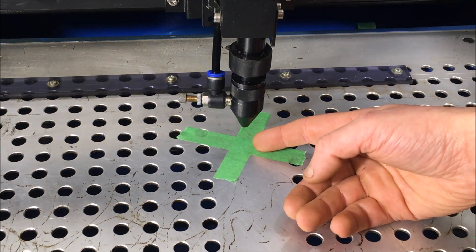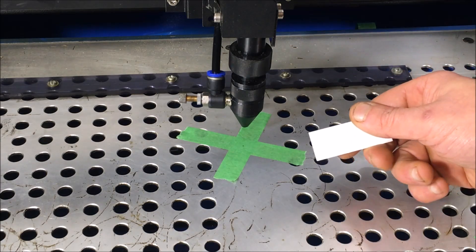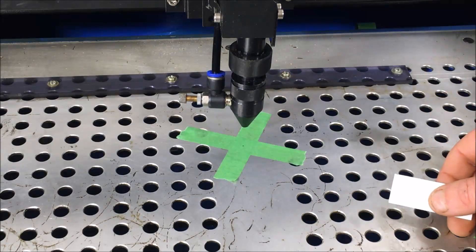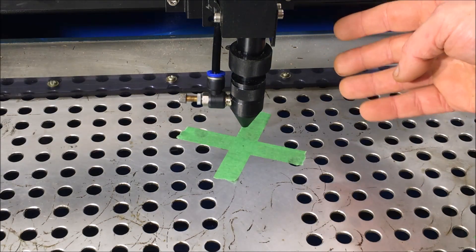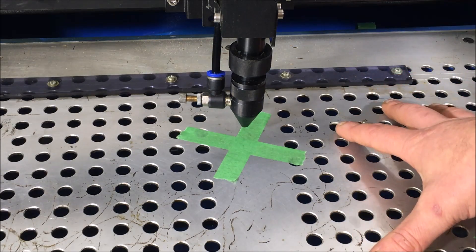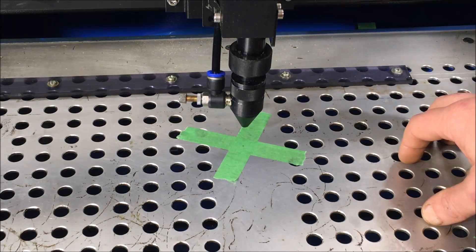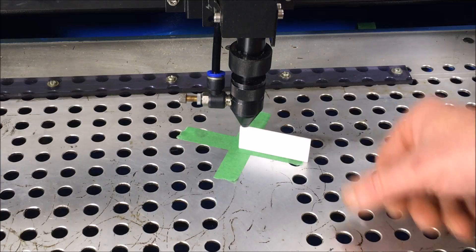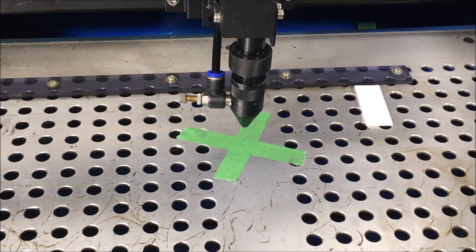The focal point is where all the action takes place. Most people are happy to just take the piece of plastic which came with the unit and use that to set their focus, and that's all they'll ever do. When you consider that the actual output power from the tube is a lot less than they claim, you've probably had to change things like the table, loose fittings, and given it a really good mirror alignment. So why would you trust the most critical section to these people who gave you a poor quality machine that they lied about?